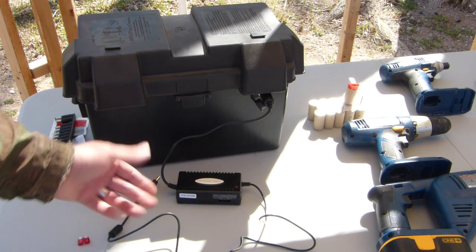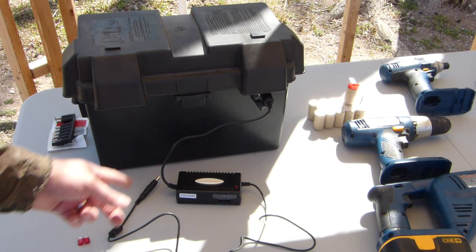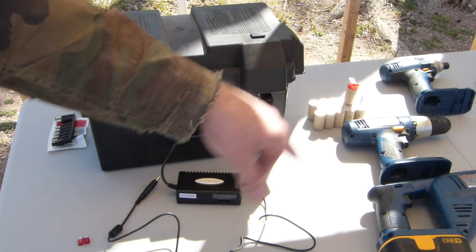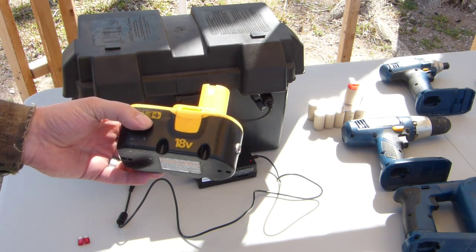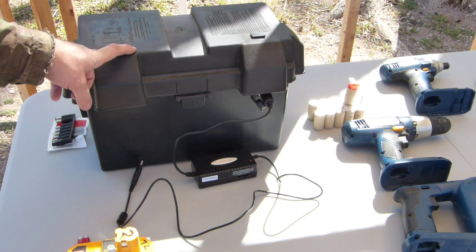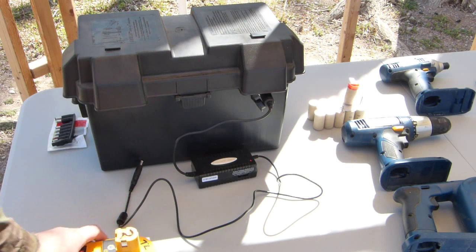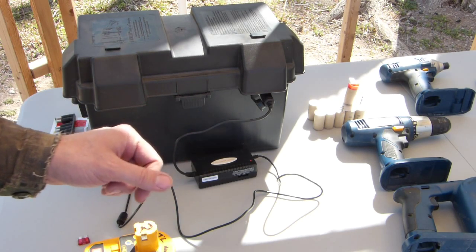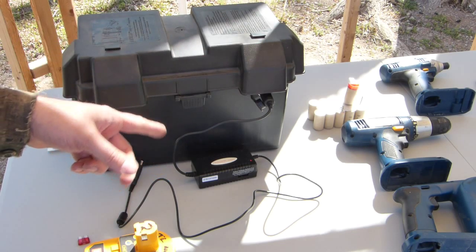This is one of the only affordable ones I found, at $21 on Newegg — it's the Syba brand. I'll put a link in the video description so you can buy one if you want to do this. For comparison, the stock Ryobi battery is about 1.9 amp-hours, while the car battery I have inside this box is about 40 amp-hours, and a deep-cycle battery can get up to 70 amp-hours in the same size — so it'll outlast quite a few Ryobi batteries.